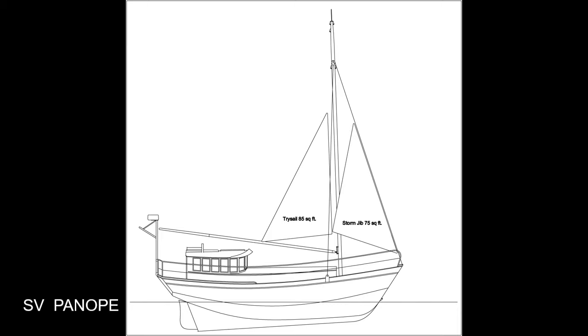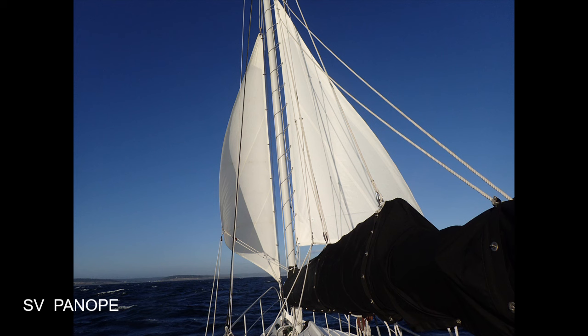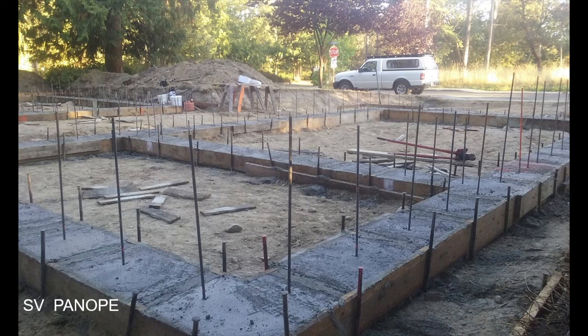One would think that with this forward nature of this sail plan, the boat would be having lee helm or a tendency to turn downwind, but I can report that it's very well balanced. Perhaps the wheelhouse aft is acting as sort of a mizzen, or maybe it's just the fact that the very long keel is tolerant of a sail imbalance.